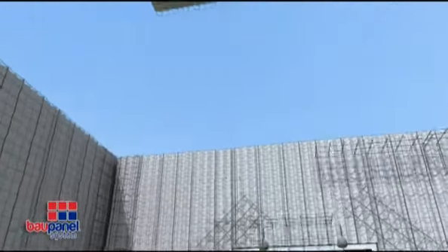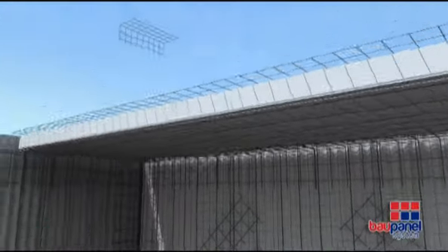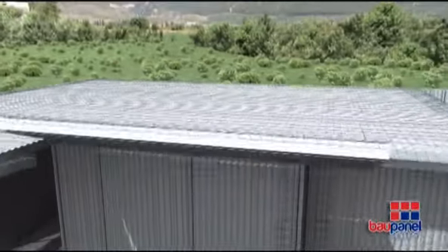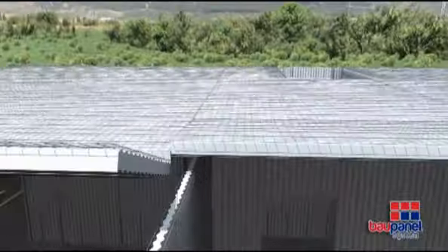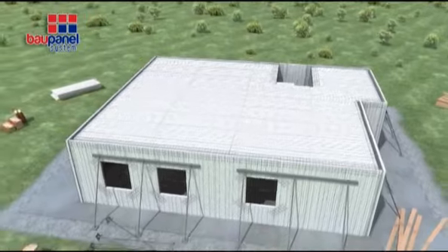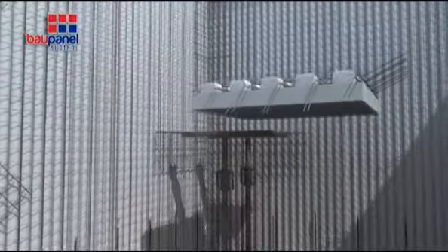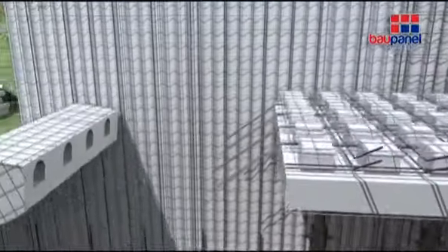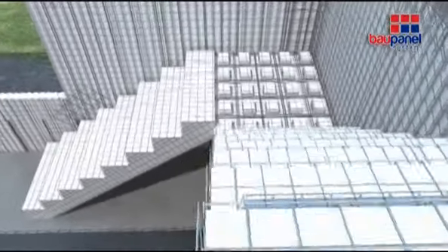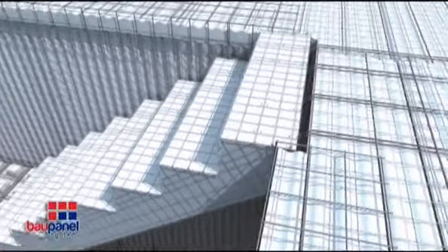Once all of the vertical wall panels have been built and attached, you can install the horizontal ceiling panels, which also form the first floor. The floor-to-wall joints are classed as articulated joints and are a vertical continuation of the concrete seam of the load-bearing walls. The staircases are made from special panels with step dimensions tailor-made for each project. Each staircase panel has four ribs, which must be properly assembled to fit the landings.